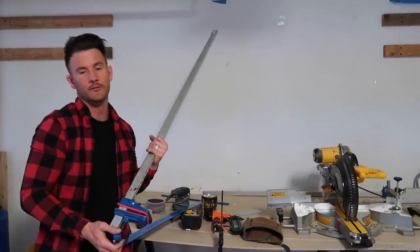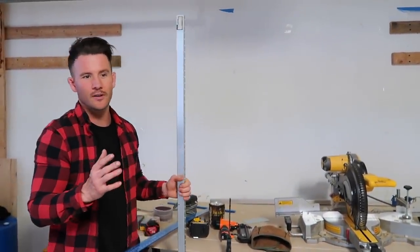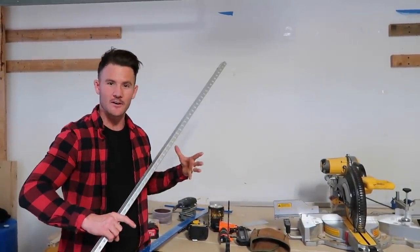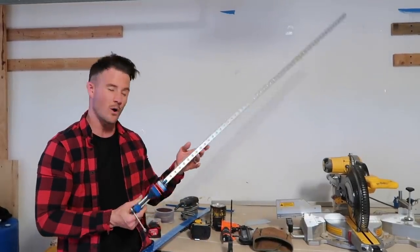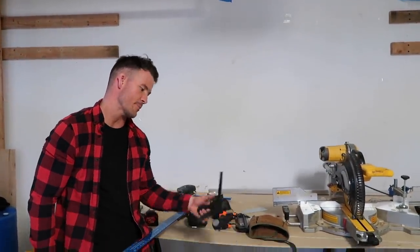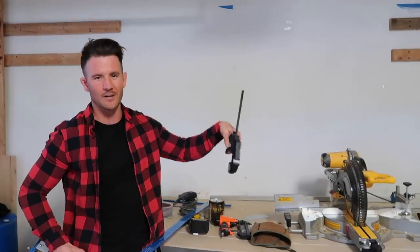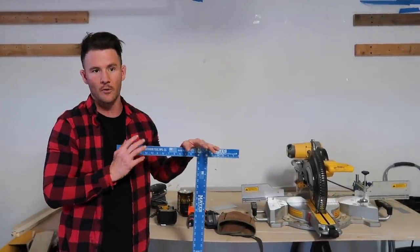Something that's not essential but makes the job a lot easier are clamps. White pine boards aren't always perfectly straight, so when you're piecing them together and want your lines to be flush with no gaps, use long clamps to pinch it together, let the glue set, and keep it even when screwing in the back. These are about $12 at Harbor Freight and come in a two-pack. A smaller clamp is also helpful when placing pieces — it can pinch down your 45s, hold them in place with glue, and make it a one-person job.